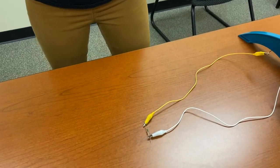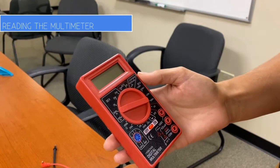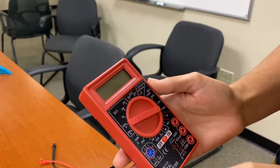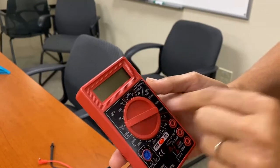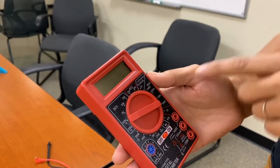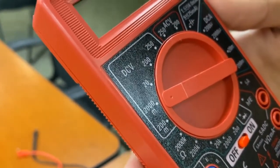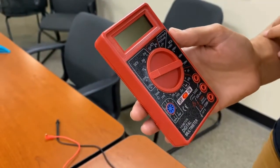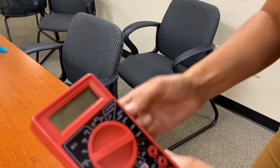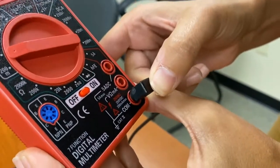What we are measuring is the voltage across the resistor. We're going to work with the digital multimeter. First, we're just going to check — there's an off and on switch, and we're going to stay in the upper left window. We'll be looking at the DCV, which stands for direct current voltage. Have your students stay on 2000 millivolts, then take your black jack and put it into the COM, which stands for common.